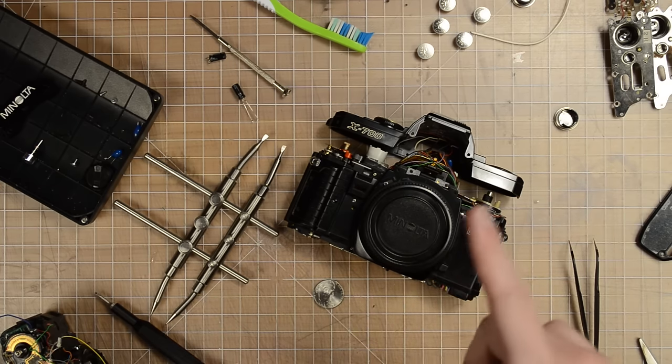This bottom plate is from a failed experiment I did about a year ago to a Minolta X570. In an area that I sanded, the primer underneath was getting shiny, which got me curious whether this was in fact conductive primer. I pulled out the multimeter and it turns out I was correct. This is pretty interesting because it means the reason why all my paint removal methods failed is because the coating on here isn't paint — it's powder coated. I'm not sure how they managed to do this at the factory because these parts are made out of ABS, which has a pretty low melting point, lower than most powder coat curing temperatures. The good and bad thing about powder coating is that there are really only three methods to remove it: heat, some kind of really strong chemical stripper, or sandblasting. I don't have a sandblaster. The chemical stripper is off the table because it'll just melt the plastic underneath. And heat is kind of off the table because it will warp and melt the plastic — however, I thought I might be able to bring the temperature up gradually enough to loosen up the powder coating without warping the plastic.